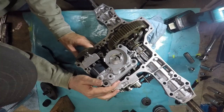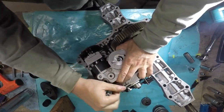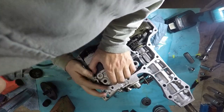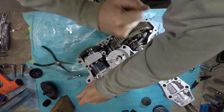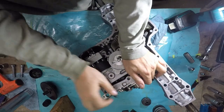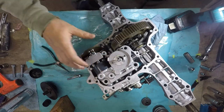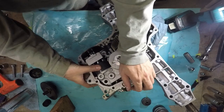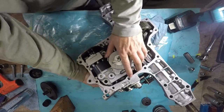Okay. It's starting to get a lot of spring pressure here. What's the problem? It's got to fit down over the shaft for the freewheeler. Tentatively, again. Anything I got to worry about is if the freewheeler pin fell out. And this is how I'll tell. If this pushes out, because it was open, if this pushes out, I'm good.